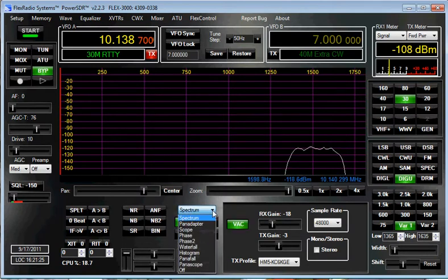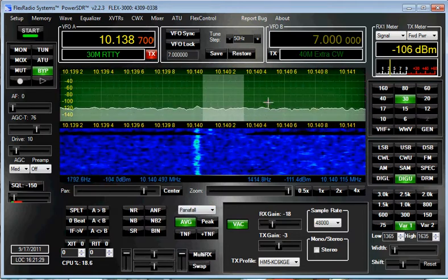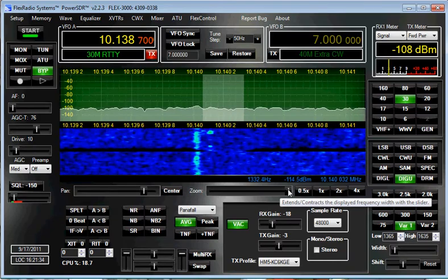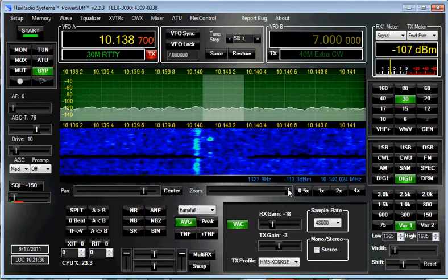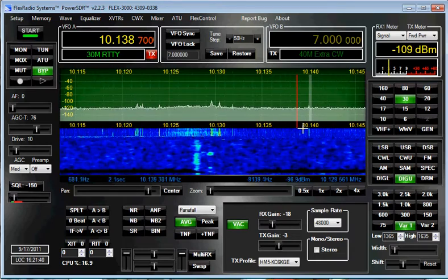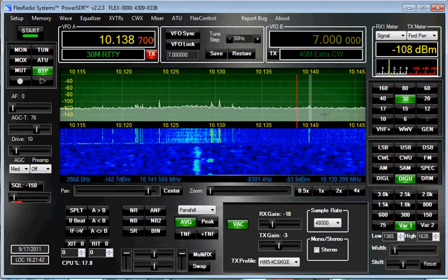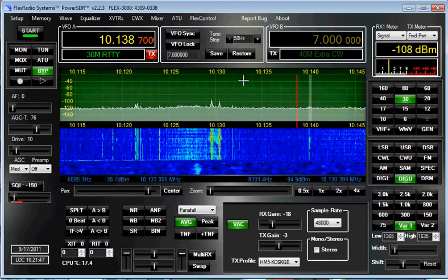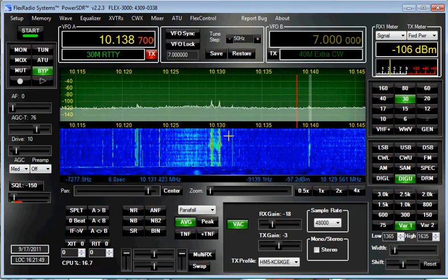This other feature I'm going to show is how I have this zoomed in. I'm running at the lowest sample rate possible for my Flex 3000, which is 48,000. So I'm going to zoom out, and you can see here — this is the whisper segment — you can see that signal that was outside of the whisper pass band. You can also see all this noise that's in my shack.